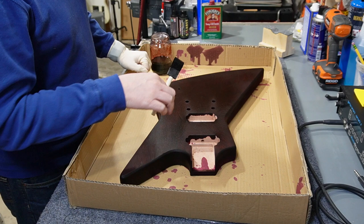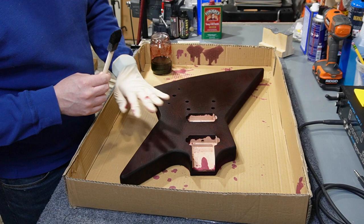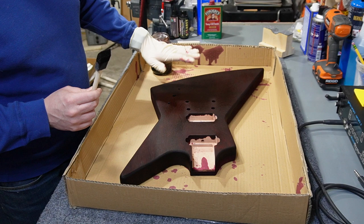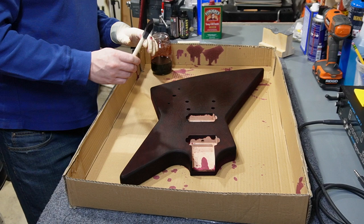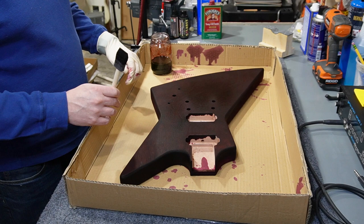I've taken some risks I might not normally have taken, but I'm putting the dye on thick because of the runs and drips - the thicker I lay it on the better it looks. The wood soaks up a certain amount and it really doesn't seem to get any darker after a certain point. This maple top is a little bit too dark to actually see much of the burl, but I'm actually okay with that. I'm just touching up the sides and I'll give it a final coat probably tomorrow. Thanks for watching - give me a like, a comment, and hit that subscribe button if you haven't yet.